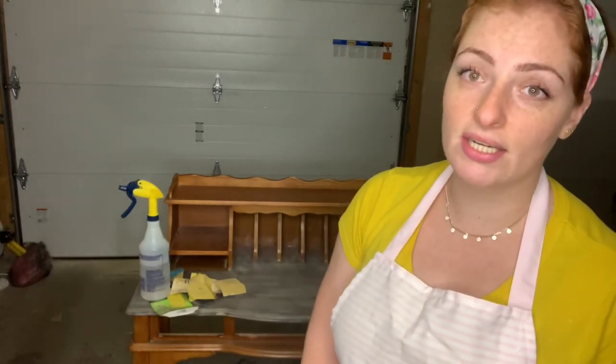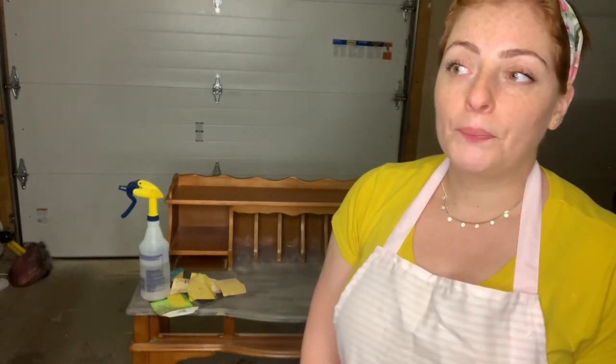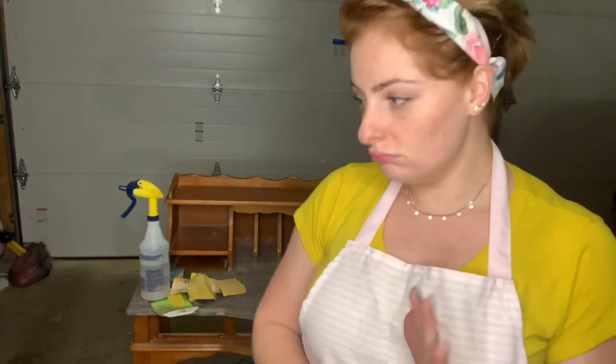This is very easy to do but very, very important and necessary. If you don't do it, you're basically wasting your time — the paint won't stay and the wood will not absorb the paint. One more tip: if the finish is a very high oily-based finish like polyurethane with a lot of coats and stain underneath, I would recommend using a paint stripper to strip it all off, then sand lightly, and then go ahead and paint.